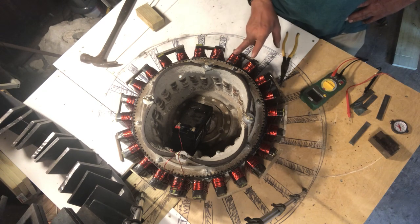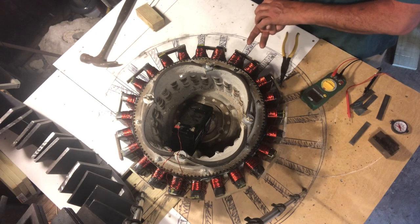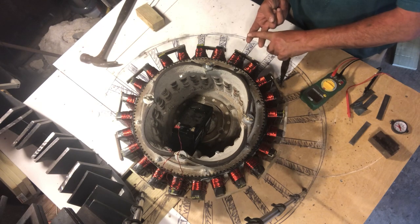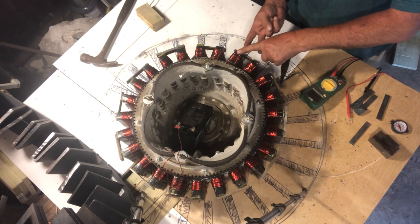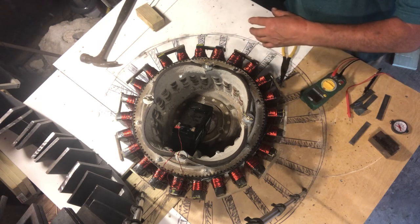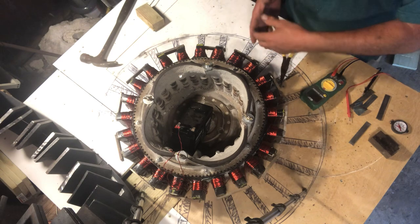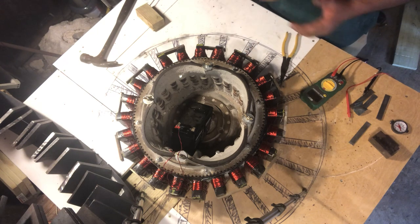That's how the peak shows up on my oscilloscope and on my analog meter. My analog meter was in sync with my oscilloscope — you could visually see the needle staying down longer than it goes up. So every time a pole passes, to get the wheel turning in a resonant way, you have to have the opposite pole appearing so it tracks the wheel, pulls the iron, and flips the poles — without building in resistance in the magnetic field.